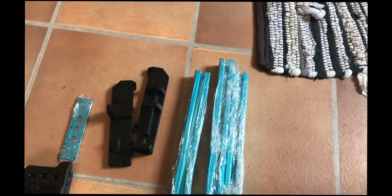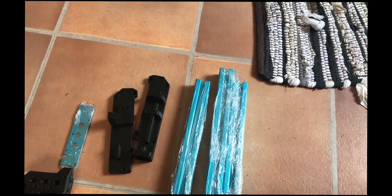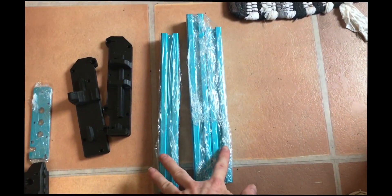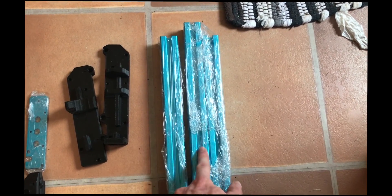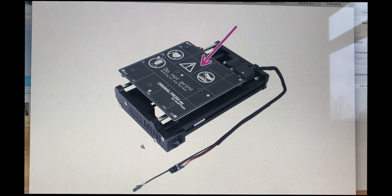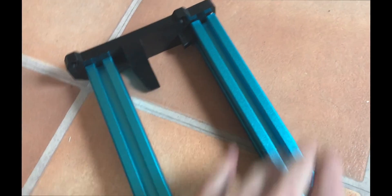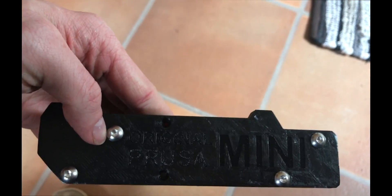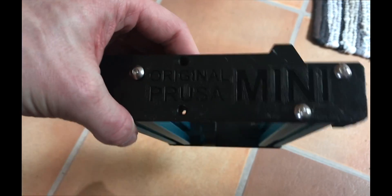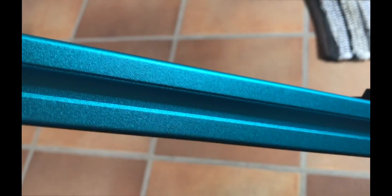So we're going to start with the axes carriage. This comes from really 2 carriages: the Z-axis and Y-axis. We're going to start with the Y-axis. We've got 3 extrusions — I think it's these 2 extrusions the same size, and then that one's the Z-axis. We're going to try to connect the plates to them. So we got something on the frame assembled — the 2 front plates with the extrusion rods. Looks like the extrusion pieces use an M5x16 screw, 2 on each end, so 8 in total. The block nuts that were used on the MK3 power supply seem to be too small or the rods seem too big for them, so they fall out easily.